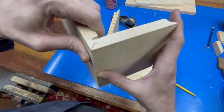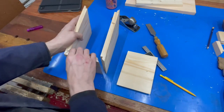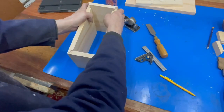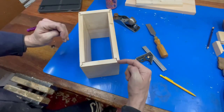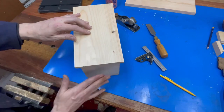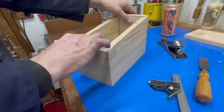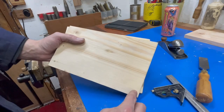They join up nicely, but as I said they're only perfect like that — there's a wee gap there, but we can work with that. So I need to trim this one — we want them all to be in the same plane. We'll put it together, mark them, and cut them at the angle. Same way with the roof — we want the roof to come down plumb with the rest. The next thing we want to do is put our wee features in: our wee grooves.